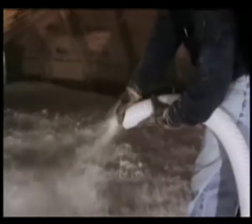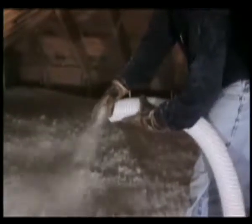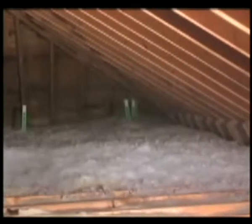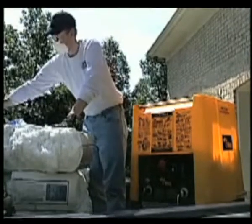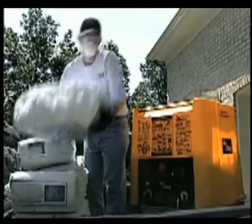Also try to limit the use of hand cupping. These techniques make the attic rulers a guide for blowing a level and uniform insulated area. The person loading the blow machine hopper should check on the safety and progress of the person in the attic every 10 to 15 minutes.